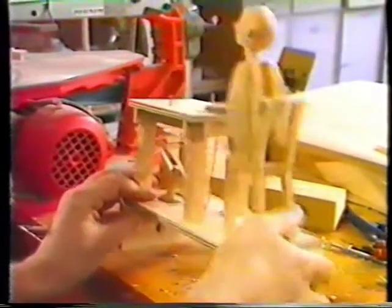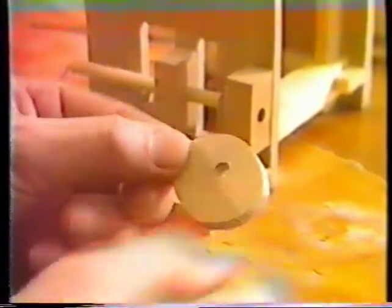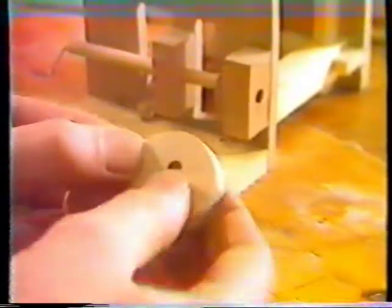Now we've got the cranking movement working to produce this spaghetti upwards surge, we're going to have to add the piece of machinery that makes the jaw work. I've bent that lever round there at the bottom, so we're going to have a lever to waggle that, driven by a cam on here. Take this bit apart and add the cam, which isn't a circle and isn't an egg shape, it's just a shape with a bump on it. The best thing to do is put it in and see what happens.